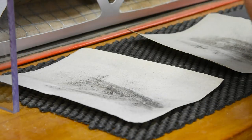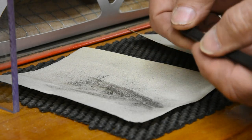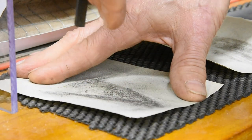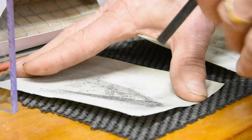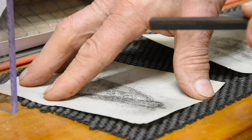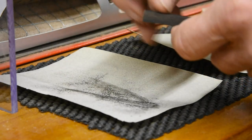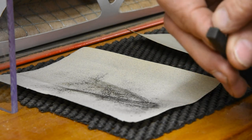And this is a 1/4 inch rod. I'm going to do about 4 to 5. 1, 2, 3, 4, 5, turn it 90 degrees, 1, 2, 3, 4, 5. Now, if this is like a 3/8 or a 1/2 inch, you're going to probably have to do more right here, maybe 5 or 6. But what we're after is just kind of smoothing out the surface there.